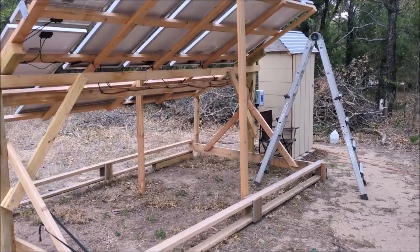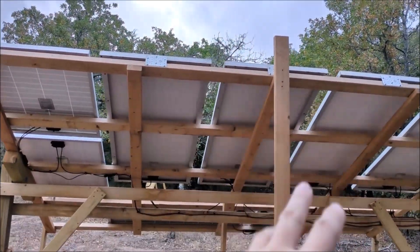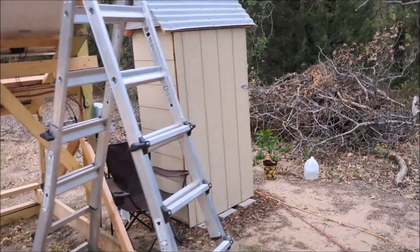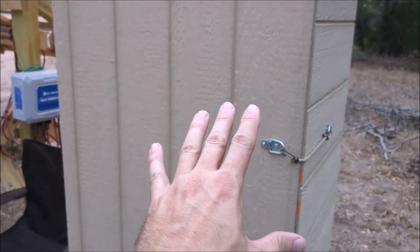However, the house battery that I currently still have connected to the trailer — I basically don't want to replace the converter charger because I don't know how long I'm going to own this trailer. I don't want to be investing money and making permanent modifications if I don't have to. So this solar system is completely separate from the trailer — it's almost 1,200 watts of solar panels, a 6 kilowatt-hour battery, and all the electronics are in here.